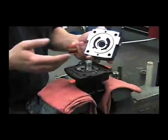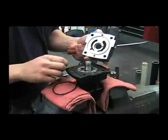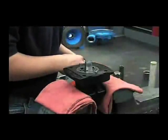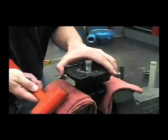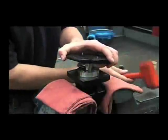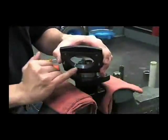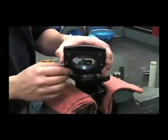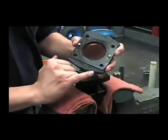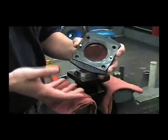At this point you can check for any damage to the bearing, the O-ring, or the G-Rotor. Next we'll remove the G-Rotor housing — you can take your rubber hammer and gently tap it out. From here you can inspect the inner surface for any deep scratches or excessive wear from possibly contaminated hydraulic oil. There's also a number on here that can be cross-referenced in the instruction manual to identify which hydraulic motor it is if the tag is missing from the pump.